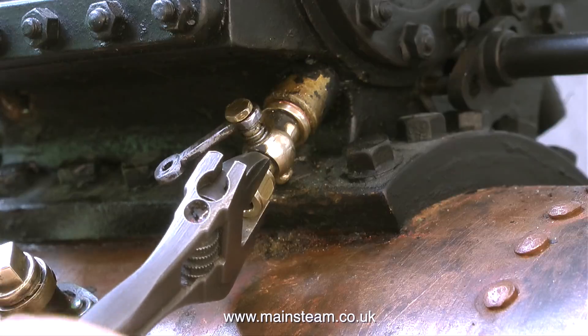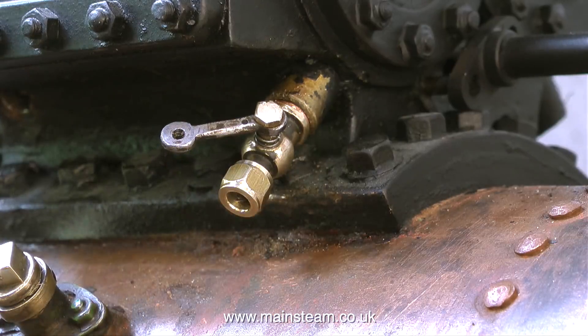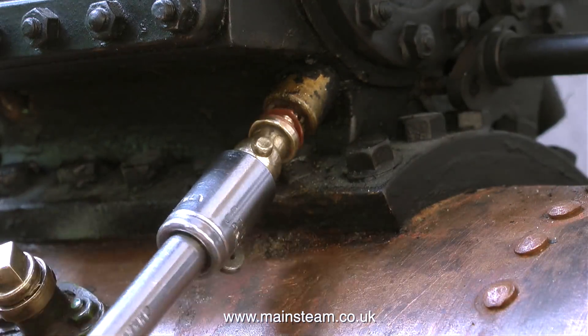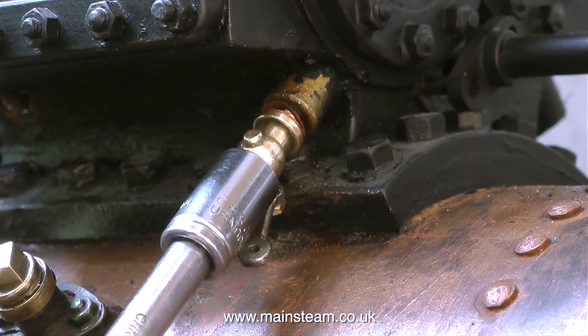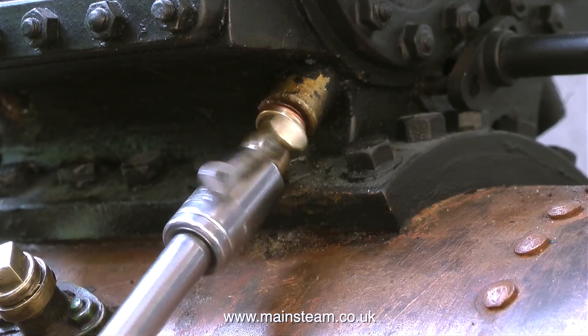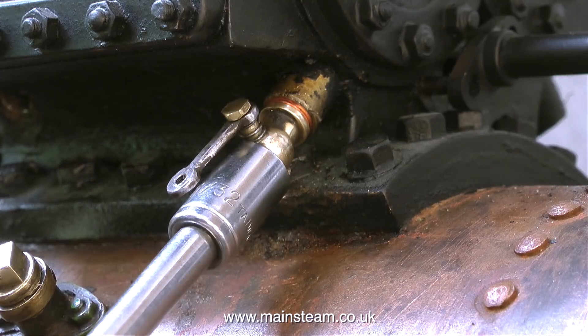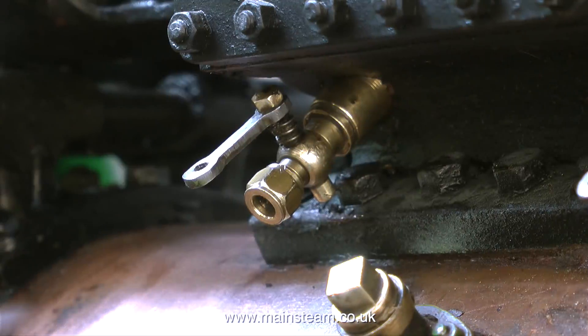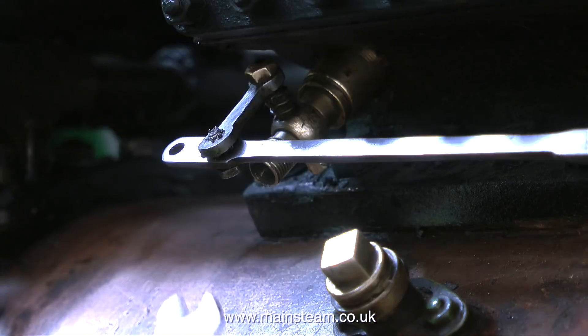I refitted the quarter-by-40 nut and put the drain cocks back in place, but by having a quick look at the photographs I realised I'd put the drain cocks in upside down — this lock nut sits at the top. It still needed trimming because during fitting it had to be rotated, and previously the lock nut badly fouled the cylinder casting, but now it doesn't. If you look carefully at the threaded part going into the adapter, you'll notice I fitted a copper shim washer. I tried various combinations of different thicknesses to make sure the drain cock ended up in the right position. At the other end I didn't need a shim washer because the adapter was attached to the drain cock and it fitted perfectly into the cylinder.